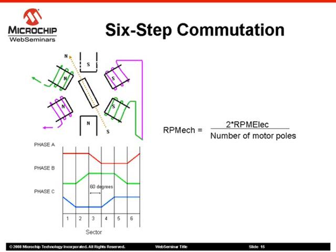When a brushless DC motor rotates, each winding generates a back EMF which opposes the main voltage supplied to the windings according to Lenz's law. The polarity of this back EMF is in the opposite direction of the energizing voltage. Back EMF is mainly dependent on three motor parameters: number of turns in the stator windings, rotor's angular velocity, and magnetic fields generated by the rotor magnets. The back EMF waveform varies as both a function of the rotor's position and speed. Detection of position using the back EMF at zero and very low speeds is therefore not possible.